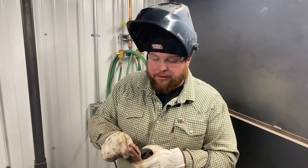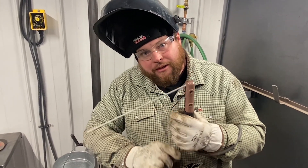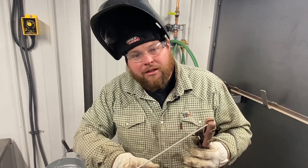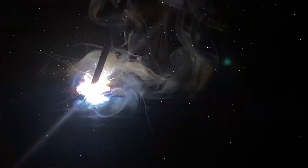I'll demonstrate the arc length again. I'm going to start off with a nice, tight arc length, then make a long arc length so you can see it. You'll see that arc start dancing around, a lot more splatter, gets a lot more violent. Then I'll bring it back in — listen to it, it gets smoother, a lot less splatter, a lot more controllable arc. I'm going to fire up, drag the rod back, take off. Got a nice, good arc length going here. Now I'm going to lengthen it — see how it's getting real violent, you can hear and see all that splatter. I'll bring it back down, get it tight. Running nice and smooth. Again, long arc length — see that arc dancing around, big ball shooting off the rod — and bring it back down to where it needs to be.